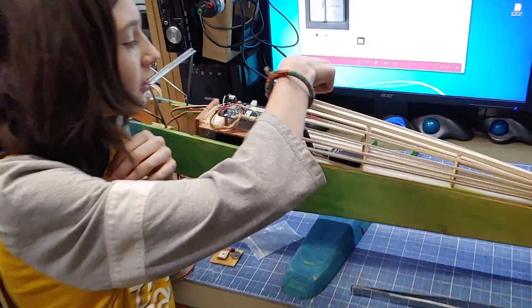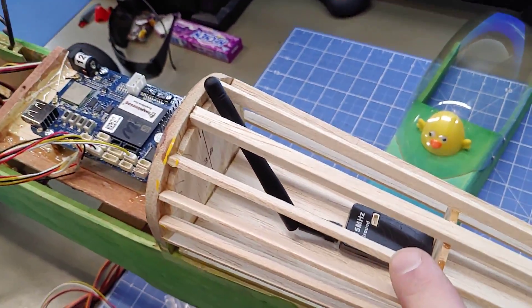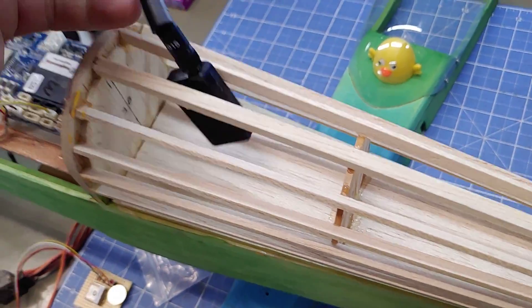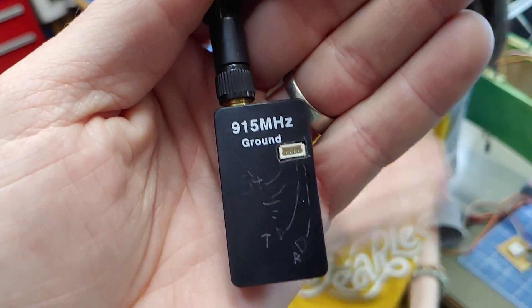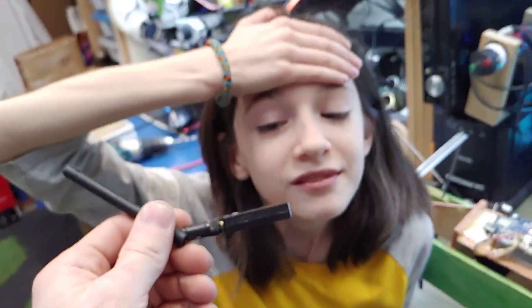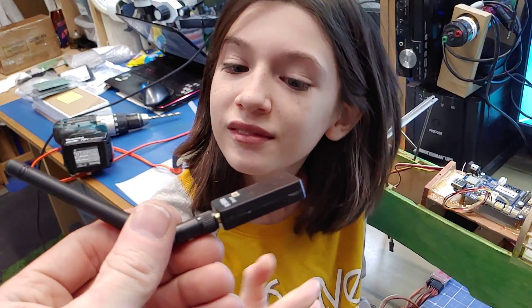What's next? Our long-range telemetry radio. That's running at 915 megahertz. We did hack this guy up — we ripped it apart, shorted some wires out, did some jump wiring. I'll have to make a video eventually on this. But basically we've put in a data port. You can see I scratched on the front what they are. So now we can use it as a receiver on the airplane. It was supposed to be a ground station — that's why it says 'ground' on it — but we hacked it to make it an air radio.